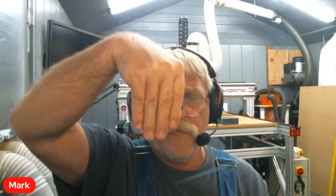I could bring the tramming gauges forward onto that crossbar, but the gantry is mounted onto the rails. So if I start adjusting 1 foot, it's going to move up with the gantry. It's going to be the same measurement because the indicator is going to go up with that corner. So, good idea, but what I'm trying to do is level it and reference off the floor, not so much off the gantry, because the gantry is going to raise with the machine.